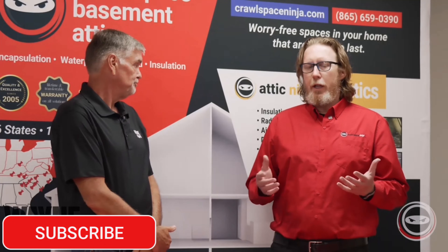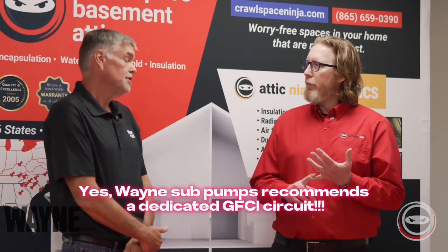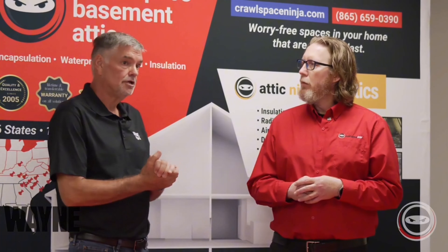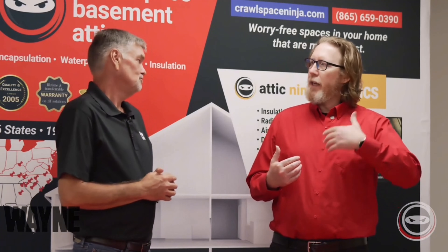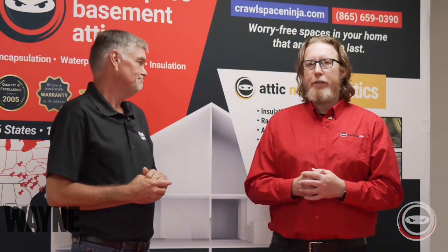I get that question a lot — do I need a dedicated circuit for the sump pumps? Do you recommend that? Yes we do. We recommend a dedicated GFCI circuit, and the main reason we want a dedicated circuit is that we don't want some other device that's in line with that product to fail and render your sump pump unusable. Even though you're using less than five amps, something else could be taking up that amp draw and trip that GFCI. That's correct. All right, that's good advice, Mike.